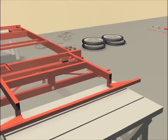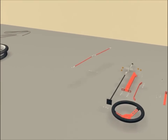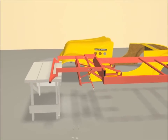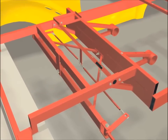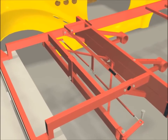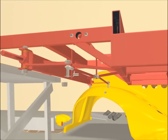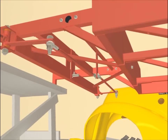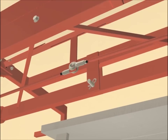You are now ready to install your tie rod ends. The tie rod ends will be placed on the spindle arm extension and bolted into position with bolts and washers. The middle of your tie rod ends will be bolted into the rack and pinion assembly.